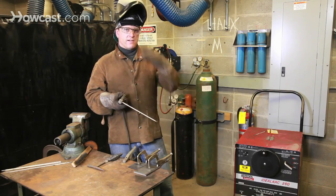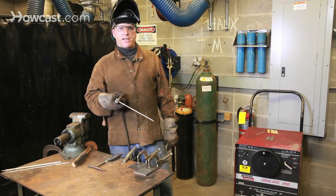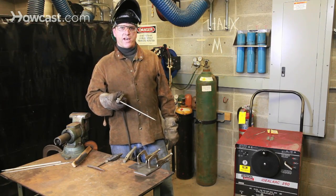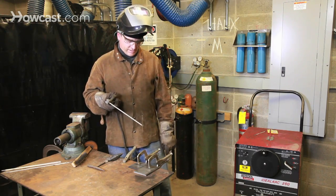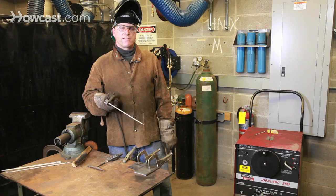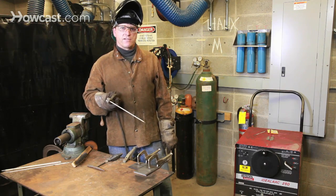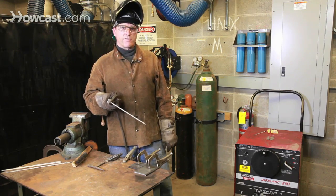After fitting, the most important thing to make sure that your welds are strong and that your forms turn out the way you planned is to make sure that they're clamped securely to the table or to themselves, because heat will distort your welds. It'll cause flat surfaces to buckle and long surfaces to twist.